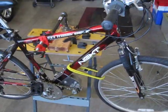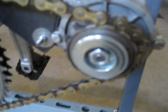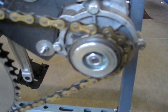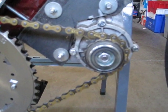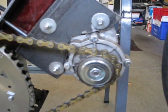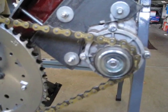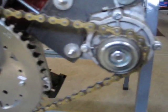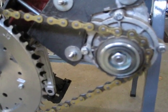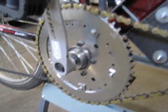Now I'm going to show you the upgrades I did to this bicycle. The first thing is the drive system has changed. I used to have a homemade shaft adapter for this MY1018Z motor, and that was working pretty good, but it was starting to get worn out. So I ended up buying a shaft adapter from statinink.com that fits exactly onto the motor with the correct key shaft. I also replaced the 14-tooth freewheel with a 13-tooth ACS freewheel sprocket, which allowed me to change the size of the rear gear — smaller gears mean less chain and a little more efficiency.